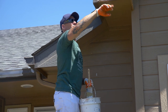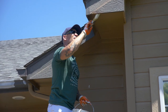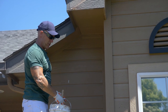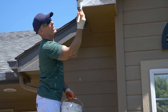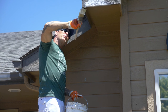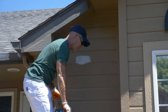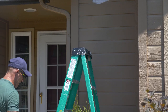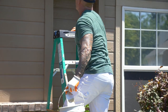There's a corner right here that's got some swelling and peeling on it. It needs to be caulked too. It's always best to do your priming before caulking — that way your caulking will stick better to a primer than it will to bare wood or even this cardboard material. So it's better to prime first. It's not a hundred percent necessary, but it's just good practice.